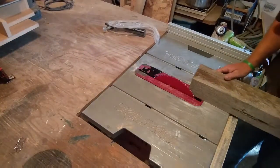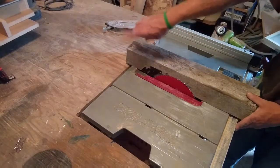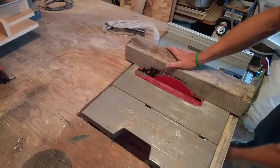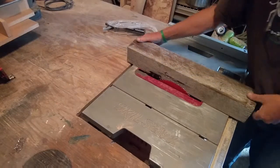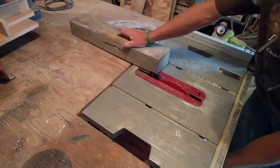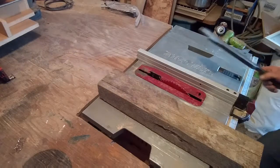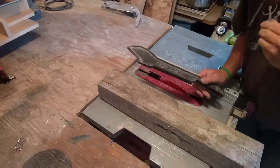Now what I'm able to do is run this piece of wood through at multiple depths. Because it is quite a hard wood, I'll make multiple passes — probably four to six passes. I'll go about three quarters of an inch deep, turn it all the way through, flip my log end to end, and then go again. Take consecutive passes until you have the top of your blade just past the halfway point. Always wear your safety glasses, and always use push sticks.